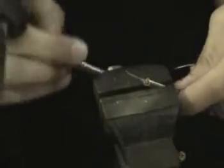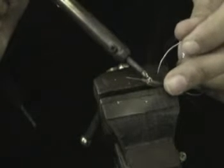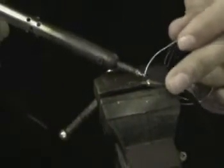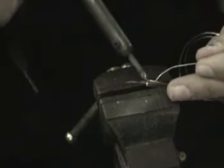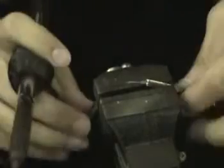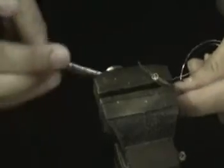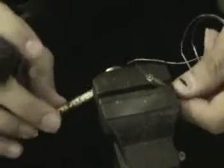You don't need an excessive amount of solder. Just get it affixed into place nicely. There we go. Not too hard. Kind of like spot soldering — instead of just blobbing it on, just heat it up a little bit, apply a bit of solder, and just let it flow. There we go. That's going on nicely. Make sure we get that nice and shielded up. It doesn't have to be super perfect.